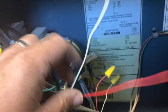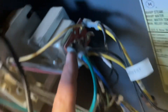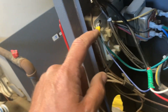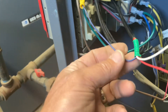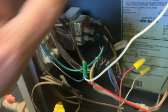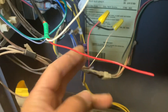I have my red, my white, and my blue wire. My blue wire is common, and here's our common terminal on our transformer right there. The green, which is neutral/ground, is going to that screw there. So I took my blue wire — which is common on the thermostat — and put that to our ground there, same common right there.